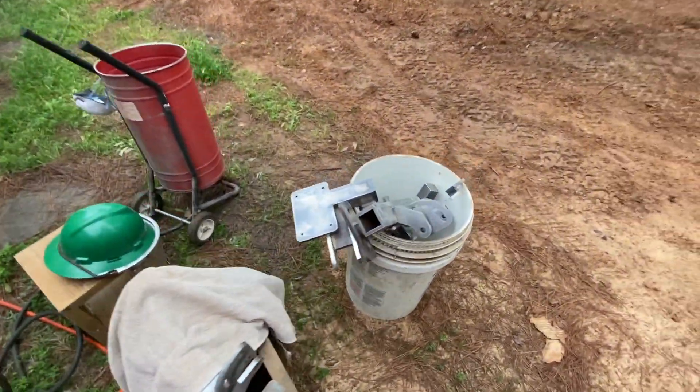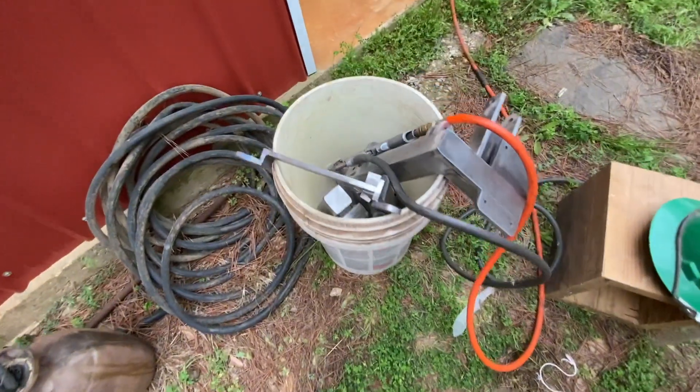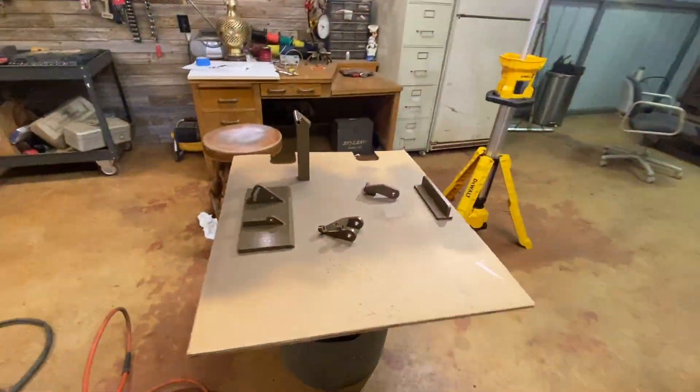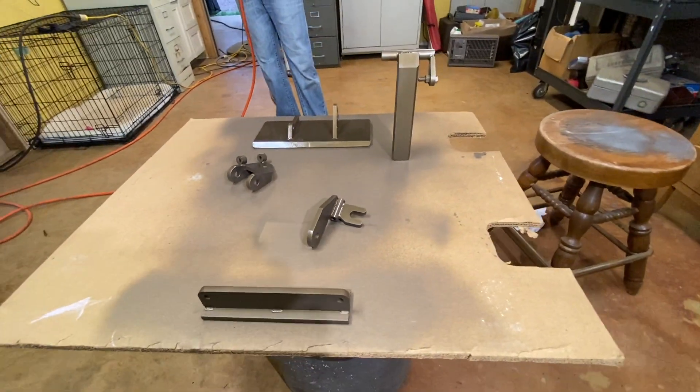We're about to get it put together. We're sandblasting it — a little fine grain sandblast to give it a little tooth. And then we spray it with a coat of Cerakote. This is not the kind of Cerakote that we bake — it was more or less like paint to me, but pretty hard stuff.